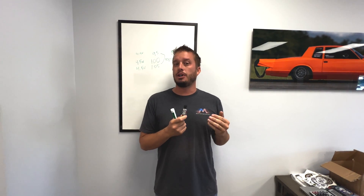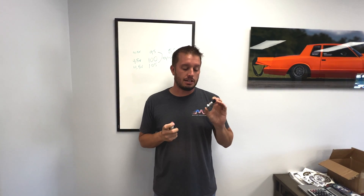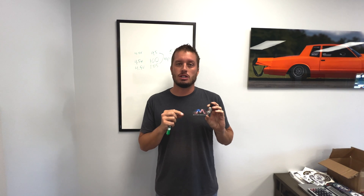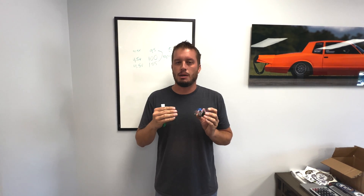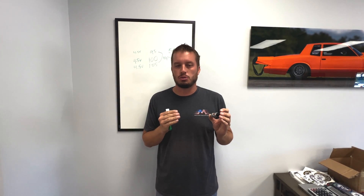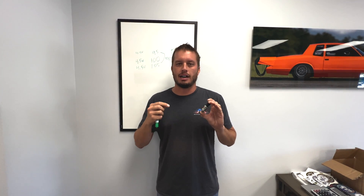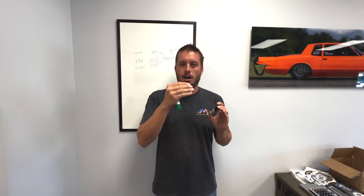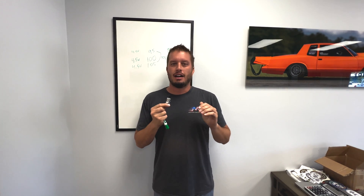I'm not trashing anybody else's product, but it's something I wanted to make you guys aware of. This is why on the Rife line we basically said we are going to lock ours in at 0.5 percent — the smallest acceptable range we could find. We're going to have some pass/fail issues where a few units fail, but we'd much rather have a closer target and closer match whether you buy a 100 PSI sensor today, next week, or you get three at the same time.